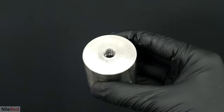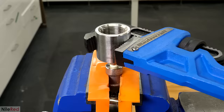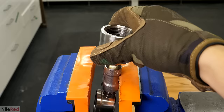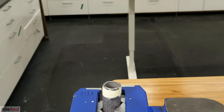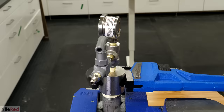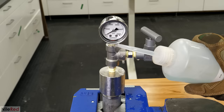I quickly cleaned the cap and all the threads, and I was ready to finish putting everything together. I started by clamping down the part with the gauge and screwed on the cap by hand, then using a pipe wrench I really tightened it down. With this upper part of the chamber ready, I did a quick test — I clamped down the lower pipe part, dropped in some dry ice, and quickly screwed on the upper section. The dry ice was slowly turning back into CO2 gas, and with everything sealed the pressure was slowly increasing. I shot some soapy water onto it to check for leaks. As the dry ice turned back into gas, it was cooling down the pipe a lot and caused most of the water on it to freeze.